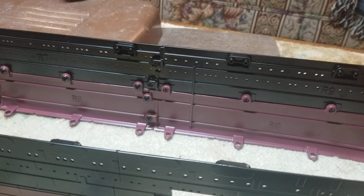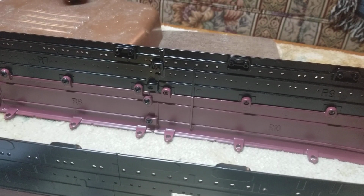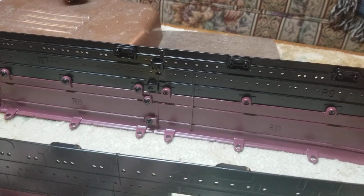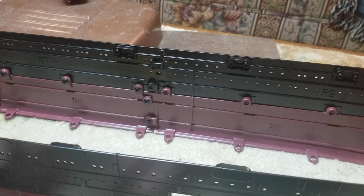Alright, now we need the screws, I'm pretty sure. Let me get my book turned here. Step 2. Fix the forward end of part 88A in place with 2 LM screws. You will need to use the Allen key supplied with issue 15. Then tighten them. Okay, so we got to first put 2 LM screws in the front, which I guess holds it all in place for the rest of it. So we'll do that. Get these 2 screws out of here.